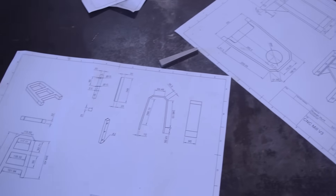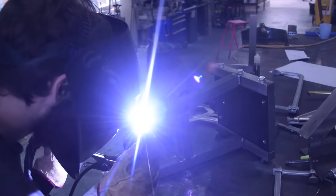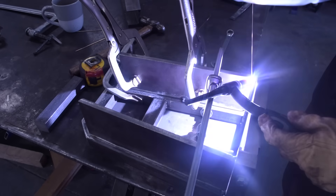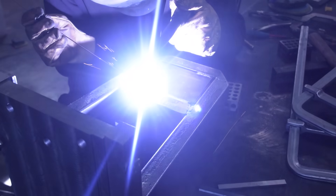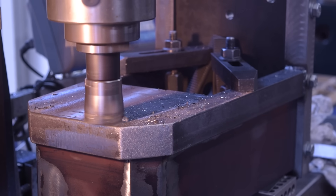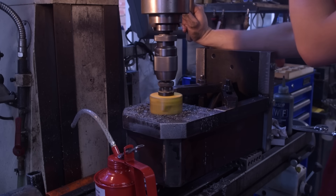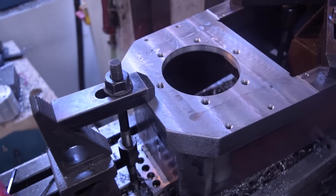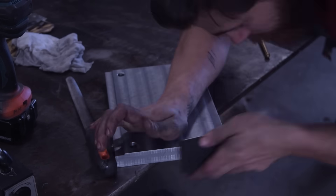In the meantime, I started on the spindle bridge. Out of 32mm square bar, I fabricated a frame, which was then filled in and reinforced with 10mm plate. This hole saw was not having a good time, but I managed to cut the spindle mounting hole and bore it out to 90mm. The design incorporates tram adjustment for the x-direction through this pivoting plate.